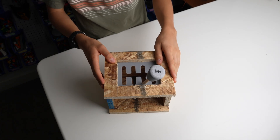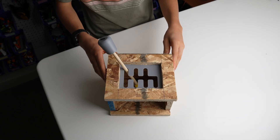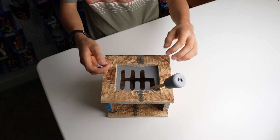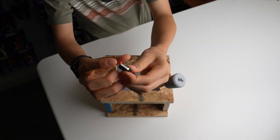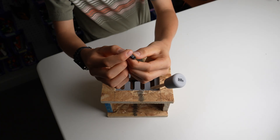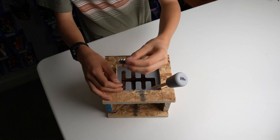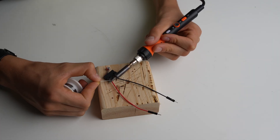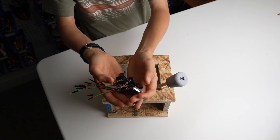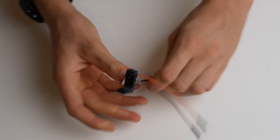The reason why I haven't nailed it together is because I haven't inserted any electronics inside yet and I need to be able to do that somehow. About the electronics — the way I'm going to detect where the stick shift is is by using these contact switches. You basically press on them and then it turns on, and the Arduino Pro Micro detects that. There will be seven of these all the way around inside underneath, and I had to solder a lot of wires to these tips. I also need to zip tie each switch to a 3D printed mount which I will then glue to the shifter.